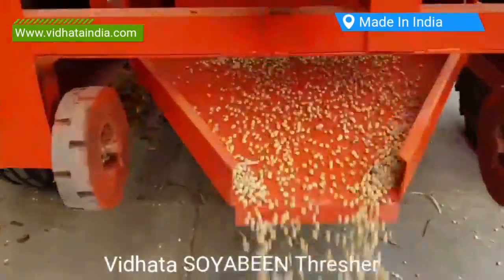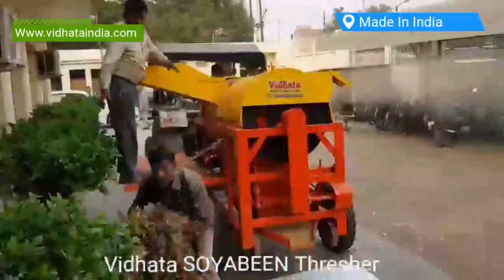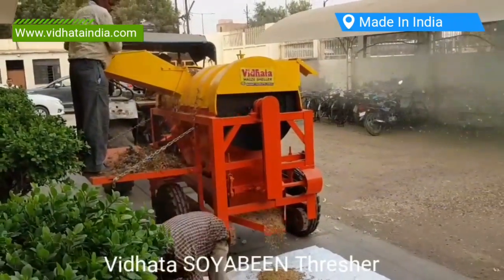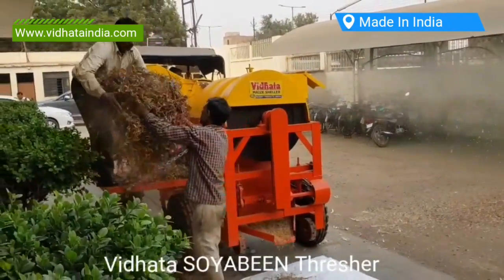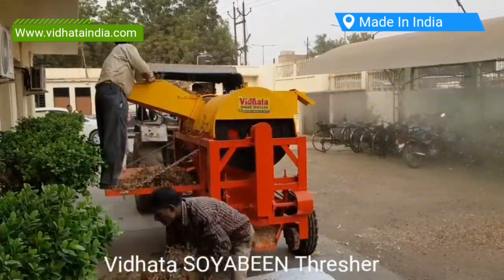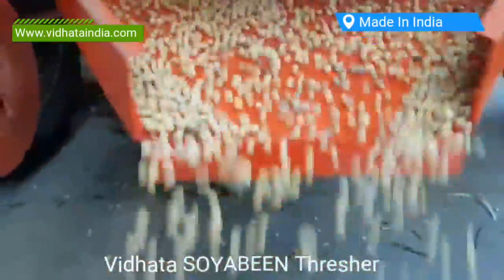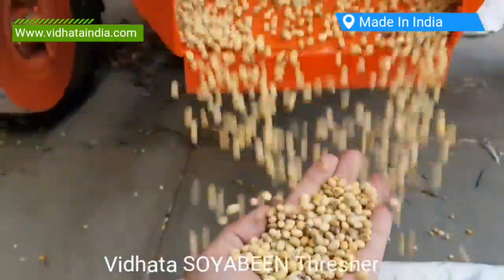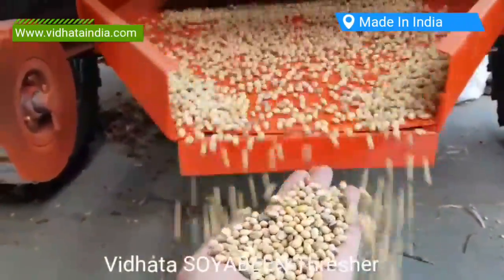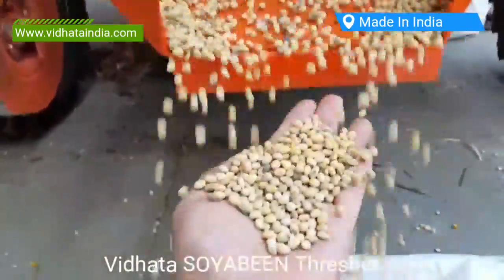The beater drum is fully flexible — the size of studs and beaters can be installed with different sizes and lengths of hammers, with options for blades used in wet crops. A special shaking sieve is installed in all threshers for dust removal. Our multi-crop threshers make special fodder for animals and are high quality, with long life and low maintenance cost.